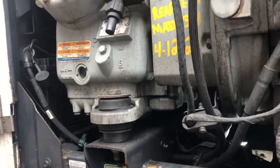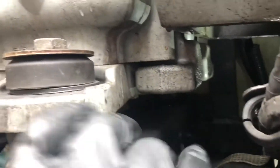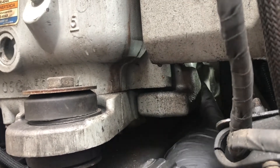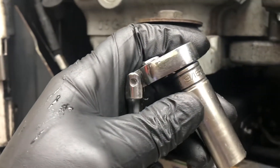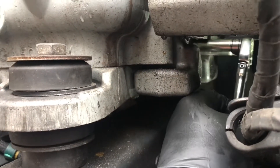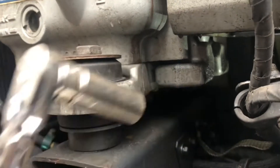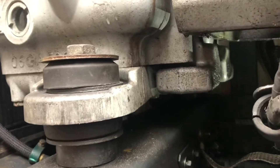This is one of the most common Carrier compressor oil leaks. This plastic container holds oil from the shaft seal. There's a bolt in the center that will come out with 9 sixteenths. You remove this bolt, drop this plastic container, drain it, and then clean this area up. And if it fills up again in between oil changes, recommend a shaft seal.